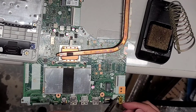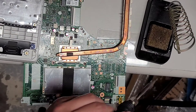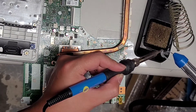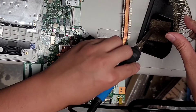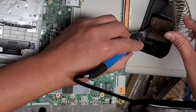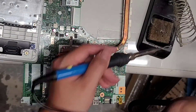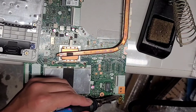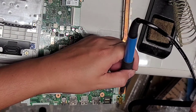This solder leg here is not holding — it's not hot enough. There we go, I have to heat it more. So you just heat it up and it all flows in place. That's what I found works a lot better — these are like cheats: you put the flux onto the surface. I'm going to set the temperature a little lower, to about 400, because it's oxidizing the tip of my soldering iron way too fast. You just put a bit of solder onto the soldering iron, then touch it where you want the solder to go, hold it there so it gets hot enough to melt and flow — and there you go, you've got a good solder joint.